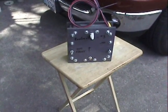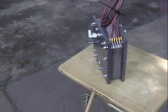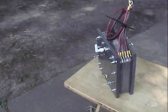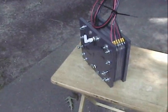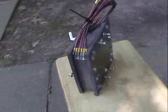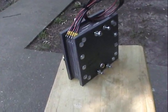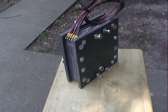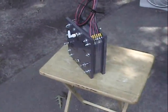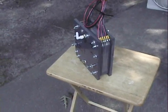Here's my completed cell with my gaskets in it. I've gone ahead and done a little pre-wiring here. I've got one side with the output for the gas to come out already installed. I haven't put the fitting on the other side yet, but I'm going to do that after I get it mounted to the brackets. Those bolts extending out go onto the back brackets, and I've got a couple here for the ones in the front. Let me crawl underneath the truck and get this thing installed.